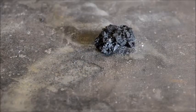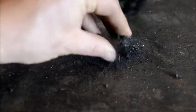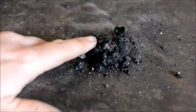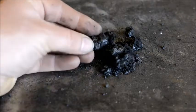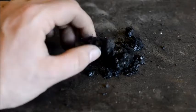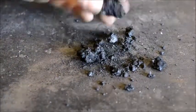So you start with your green coal. As the coal burns, it creates this stuff — it's like green coal clumped together, but very light and very flaky. You can crumble it with very easy finger pressure. This is called breeze. Breeze is what you want to light your coal forge with. After a day of forging, the next day you should have some breeze. This is like tinder for the fire on a coal forge. I mainly use green coal and do this whole process, so this is what I'm most knowledgeable at.